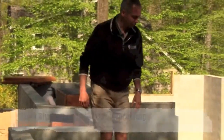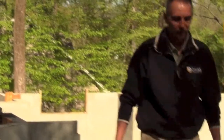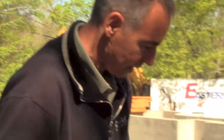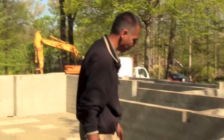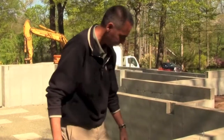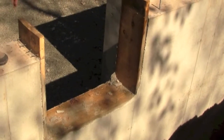We walked around before, we took our plot plan, and we measured exactly where we have to be, where our grading is going to be. So I made marks all around the foundation, which I'll show you in a couple seconds. He hasn't done this over here yet. This is where it's stripped out. This is where I talked about our wall. We put our 2x in here where our sill plate is going to be running right up against this anyway, and then they'll cut this down to size.